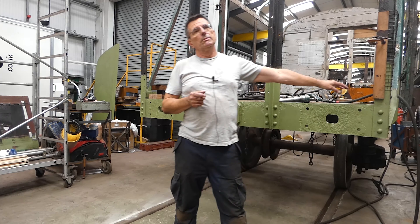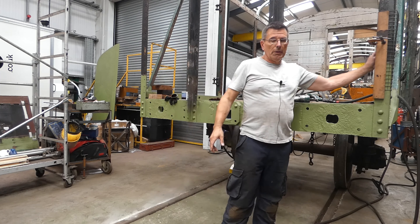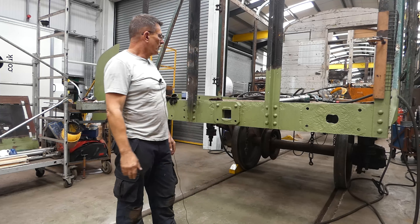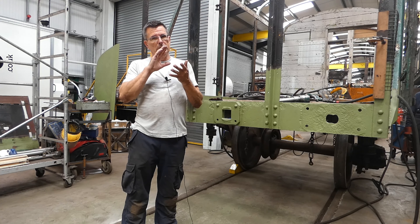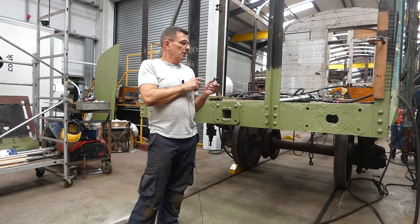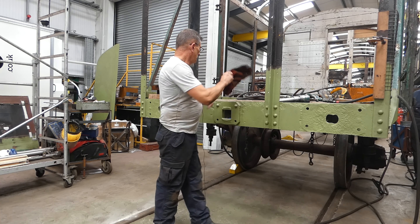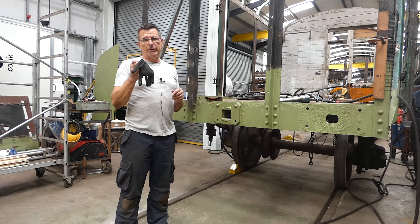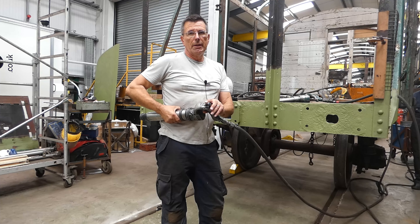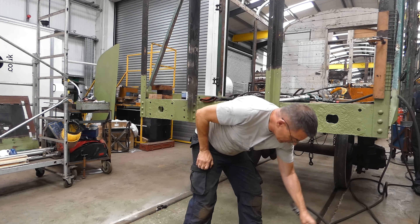We create a safe working zone. For example, the camera won't be allowed in our field of work — it's too dangerous. And we have screens, so when the guns are working together there's no danger of a slip causing an injury. Safety gear will be gauntlets, face visors, ear defenders — that's for the people on the guns. The one on the heater won't need that but will need ear defenders. You'll also find there'll be a gauntlet holding the end of the gun, because that gets very, very hot. But on the handle end it's either a very tight-fitting glove or bare hands, because that's the trigger and it's very, very sensitive. If you tap it, which you could do with a loose gauntlet, you've got a problem. That's why you'll see bare hands and tight gloves.